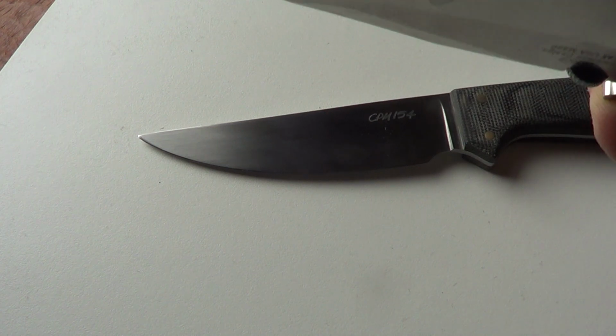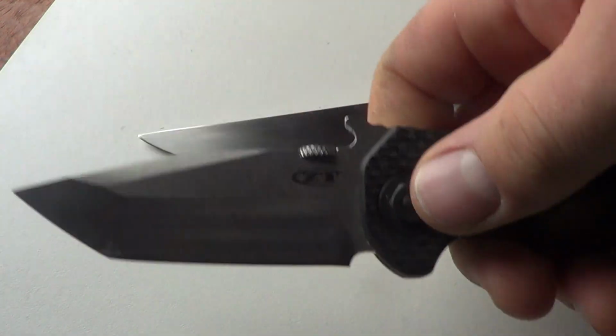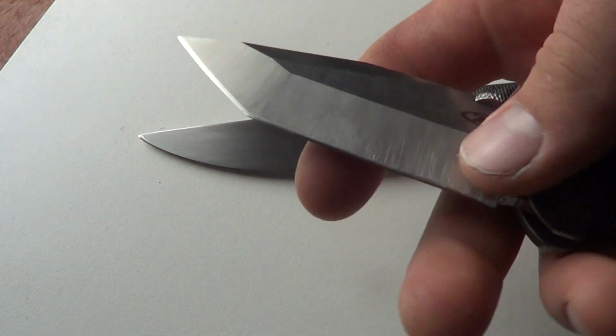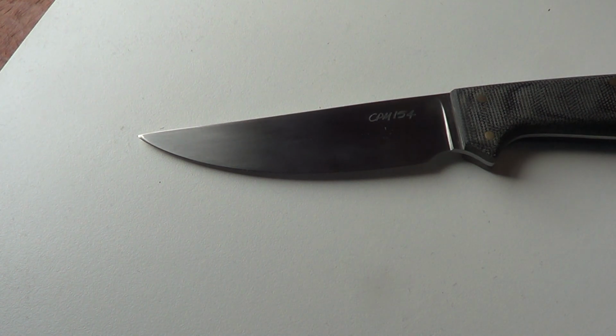This is why a lot of people will use a Sharpie marker to help see if they're getting that very, very last little bit. And another deceptive problem that I had, and if you haven't experienced it, that can really trip you up, is sometimes with a thicker edge like this, when you are doing freehand, you might raise your angle up a little bit and run a stroke on the stone, and it'll start to cause a burr formation because you're hitting the apex, but it's not really clean, and that apex isn't meeting up with the primary bevel, and so you end up with an edge that doesn't really stick. It's just kind of a raised wire edge, and at least I think that's what's going on. It won't actually be very sharp if you were to cut that off and try and sharpen again on your primary bevel, because it actually isn't meeting there at the apex. It's kind of above it.